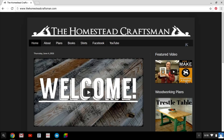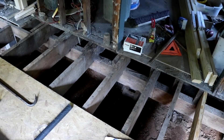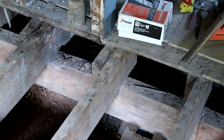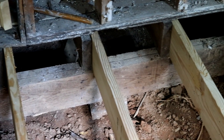Enjoy the video. Now that I've got these joists in, my next task is reinforcing the center beam in the house. You can see this center beam is supporting the floor joists from both sides of the house. It is untreated 2x8s that have been nailed together and are sitting on cinder block footings.